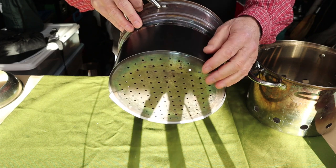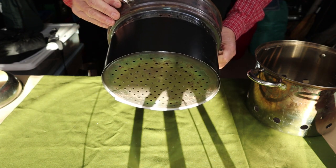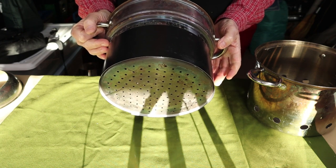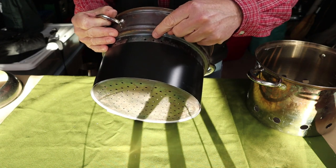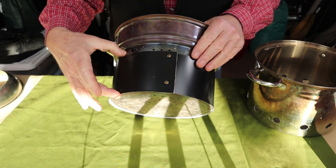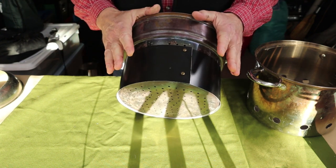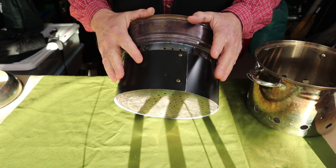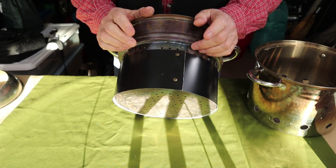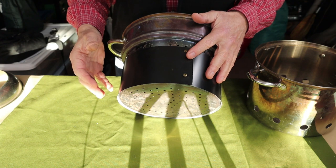Basically I'm using aluminum duct tape or aluminum flashing used around eaves. This one is black rather than shiny aluminum but it's exactly the same material, just pre-painted. I decided to occlude all the holes except the very top row, and fixed it simply by measuring, cutting, overlapping, piercing holes, and putting nuts and bolts through — very simple. The question is whether it will get hot enough to melt the aluminum flashing. I don't think so because the stainless steel on the inside should conduct most of the heat away, but that's part of what we're testing today.